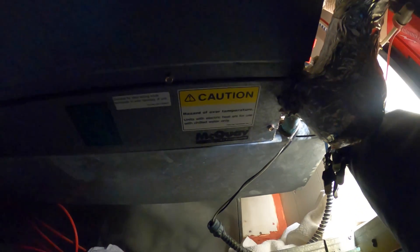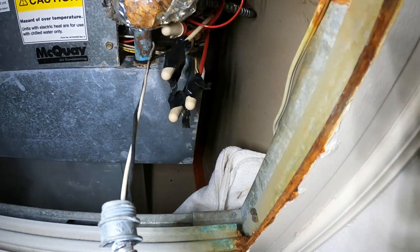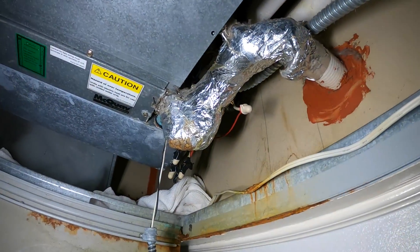This is not the first one in the building — looks like they have a lot of these. I'm going to pop this out. This should spring back, and it does spring all the way back and it's tight. This looks like a new actuator; they tried to change it but couldn't fix it, so they called us. That valve is in a very difficult place — you can't reach it from here unless you cut a hole in the wall from the other side, and even then it's going to be tight.